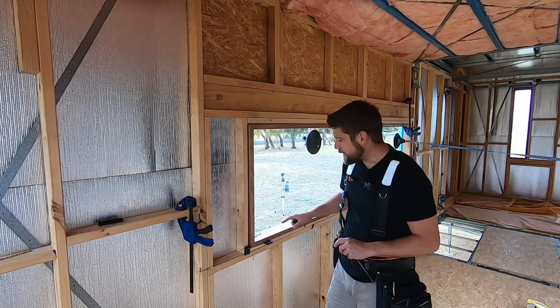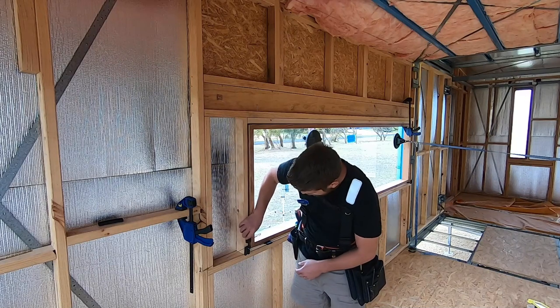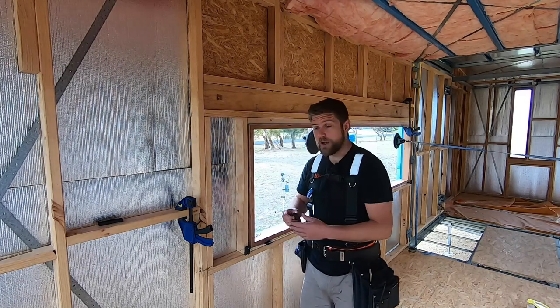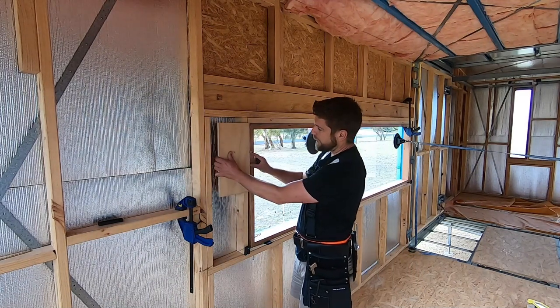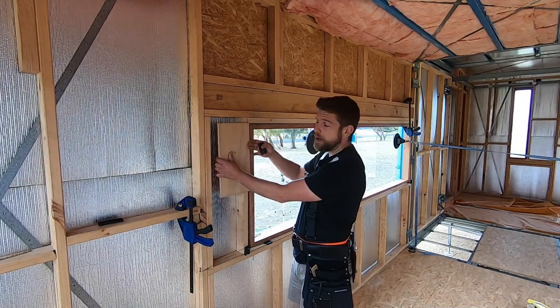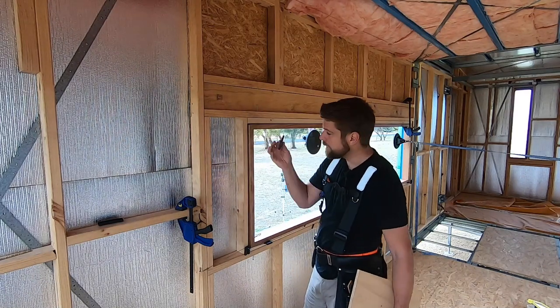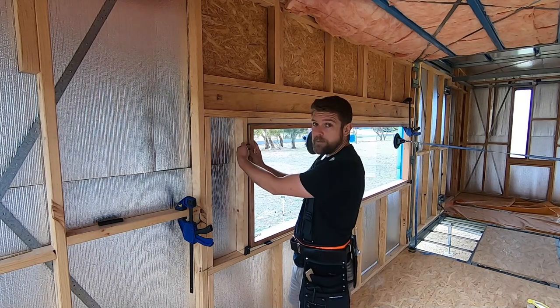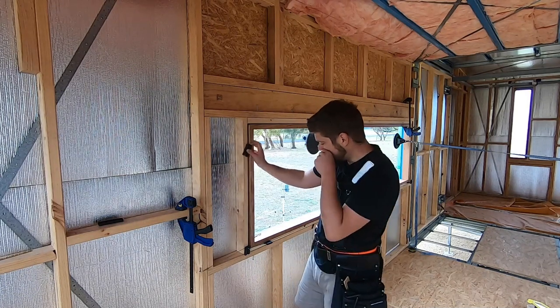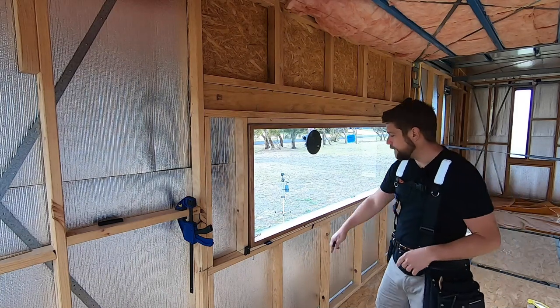So the next thing I'm going to do is to screw these in. And to do that, what I'm going to do is use a packer up against the frame here. So my plywood is going to meet my timber like this with a shadow line, and it's going to be the same height. So I got 9mm plywood plus a mil of adhesive. So I'm going to use a 10mm packer, and it's going to bring the front of that window out to the same height as the packer there. So I'll do it on the corners first, and then I'll work along, fix this bottom rail.